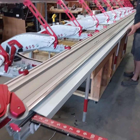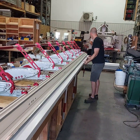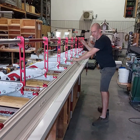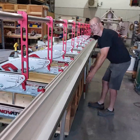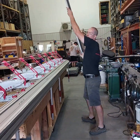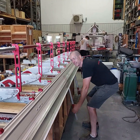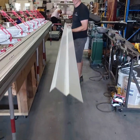I'll do two and a half inches. What I'm doing right now is I can see with that light — I can see my measurements on that two and a half inches here, and then I can walk to this end. Because I'm resting on that end, it's like having another hand holding me there. So now I can pivot here, close to two and a half inches. Lock the brake, back to the middle, take my 90. I'm happy to have that extra bend. Go back for our five-eighths for our piece of stocking fascia. Lock it in. There you go — that's pretty awesome.